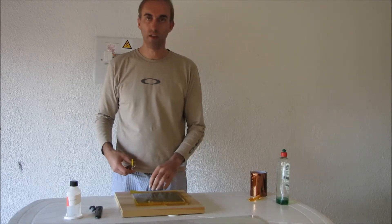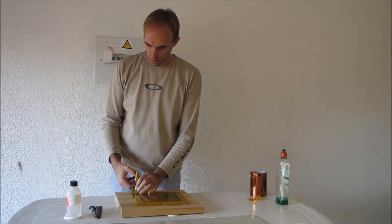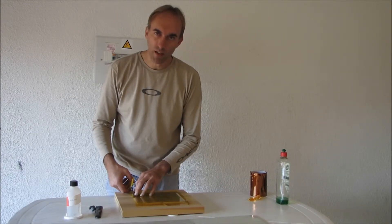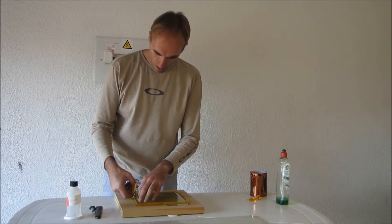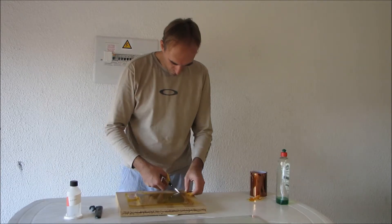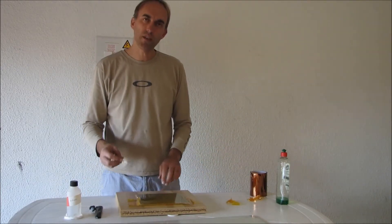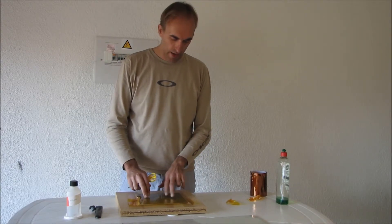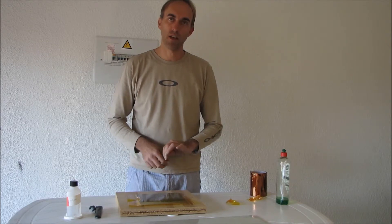So what I'm going to do now is just take a pair of scissors, cut around the outside of this thing. At this stage you're going to cut pretty much as close as you can to the edge. As you can see, there's quite a bit of water still on there. Don't worry about it too much at this stage if it lifts — it's just because it's still wet underneath. As soon as the water is completely evaporated, the Kapton tape regains its stickiness and it sticks fine.